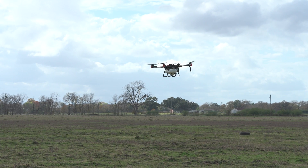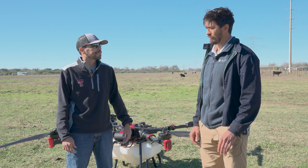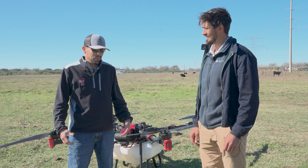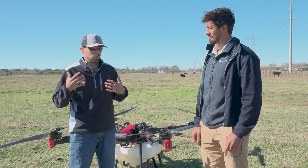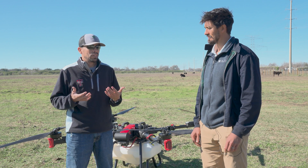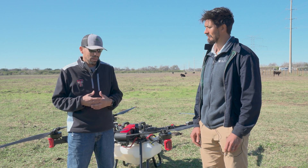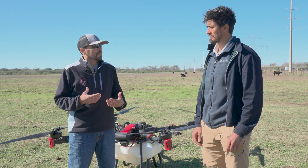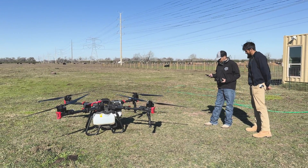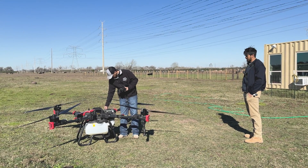We did have another hiccup with the battery — pilot error on my end. There was also a compass issue involving the RTK — I'm pretty sure the battery issue wasn't giving enough signal or power to one of the antennas, throwing it all off. When we switched to a different coordinate system it was able to ingest it, but still not operating properly. Once we let the system fully shut off, let it calm down, re-hooked the battery, connected to Wi-Fi, did the software updates and cleared everything out — we were able to rock and roll after that.